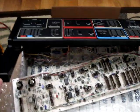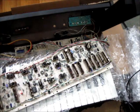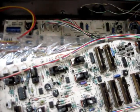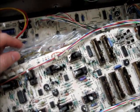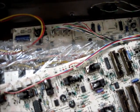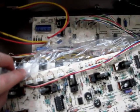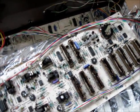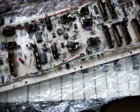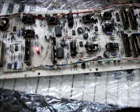As you can see it's coming along great. I've cleaned it up for you — I took it all apart and really cleaned it. I replaced all the capacitors. You actually had a power supply failure as well; you had a regulator go bad, which is a TIP-30, so I had to replace that. I replaced all the filtering caps for ripple on your power supply, so you should have clean DC output now. I also replaced a lot of the filter caps that work with the envelope generators and things like that. So you're in business.